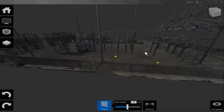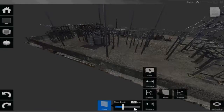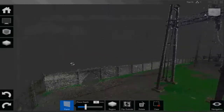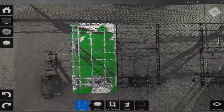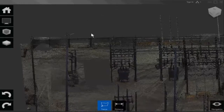She then selects several points to identify the ground and identify the base plane. Next, she adds survey points to the cloud, which will serve as reference points. She wants a clean work area where the new bay will be located, so she draws a fence around the new bay and deletes all of the existing points within that area. She continues by cleaning up some extraneous information that lies outside of the substation.